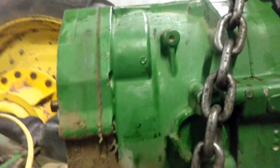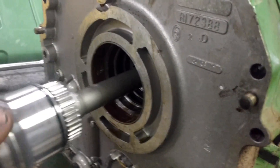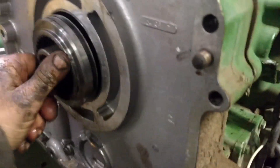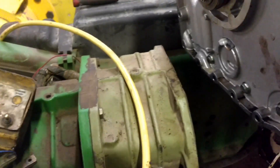I think we're going to pull all our transmission components out and get back to the pinion. We've got the power quad loose. We've got the drive shaft here — nice and tight to get that old spline back in there. We'll lift this power quad out of here. Here's our creeper transmission. Here's our range transmission. We've got to get the range and the creeper off now.